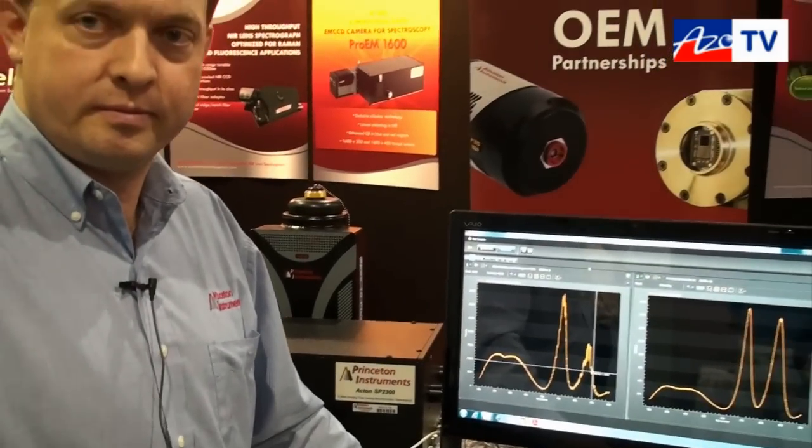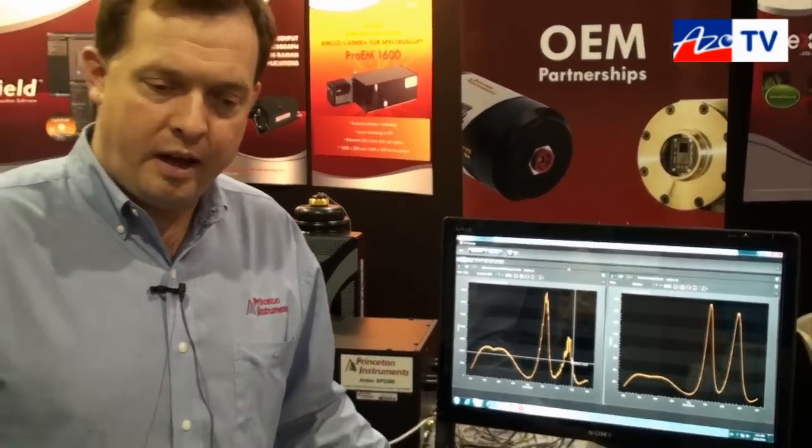What's the spectral range of the SP2300? These spectrometers go anywhere from the vacuum UV out to the mid IR, and we make CCD detectors and InGaAs cameras which cover the range from the vacuum UV and even the x-ray out to the near IR. Measurement time can range anywhere from microseconds to hours — our users vary from people doing single molecule imaging at very high speeds to people taking hours-long images and spectra of stars.